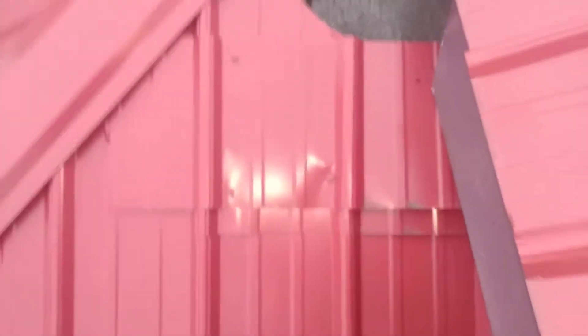Metal down there is not completely screwed. We have shingles here — I'm not sure the purpose of this because obviously all the water comes down this. This isn't even a valley — this appears to be a piece of transition they used on the front porch, probably just the extra piece they had, but it should be a valley because if not the water goes back and forth.